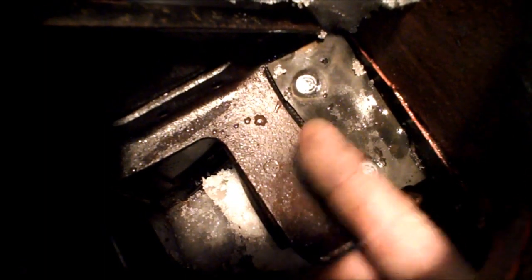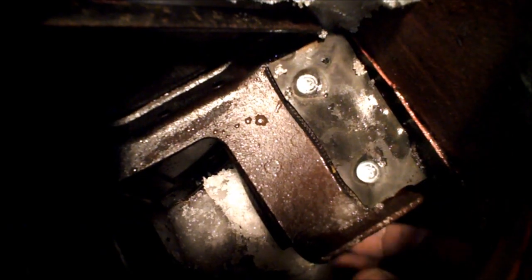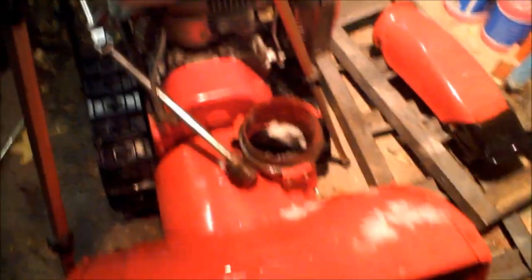They're touching about a sixteenth to an eighth of an inch, but that's what I want, because I've got that chamfered edge and I want them to wear out. The very first couple times this spins around, you're going to hear it rubbing. But after running it for five minutes, it'll be completely catered to the inside of there. And every time it swipes around, it'll completely clear all the snow and it won't clog up anymore.